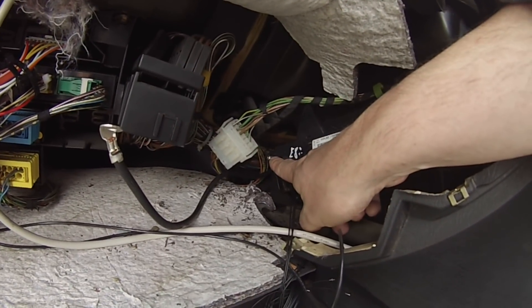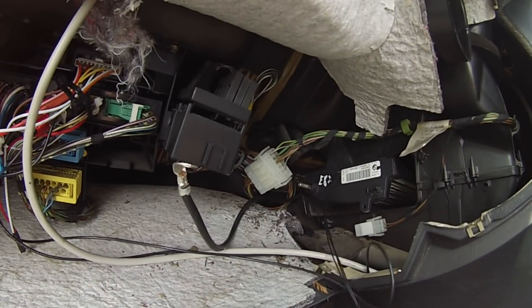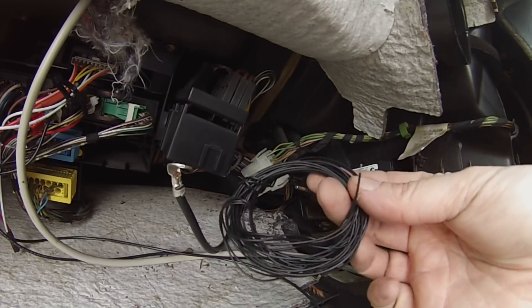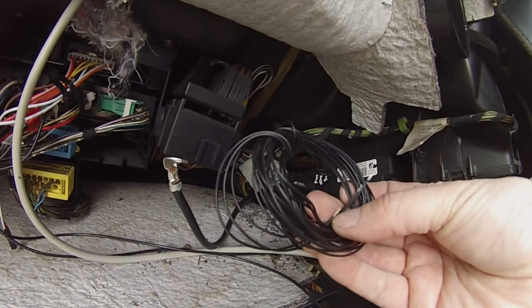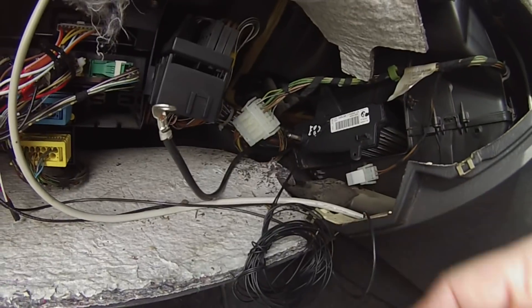What we'll have is a 12 volt positive terminal, a 12 volt ground, and a way to switch the various elements — the three power switches inside the control board — with these three wires.